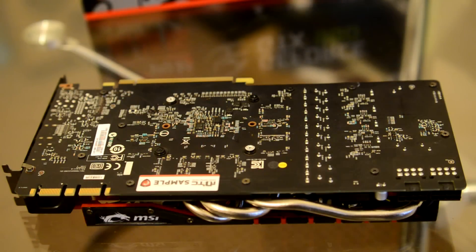The PCB of the graphics card itself is black, but you will notice there is no backplate. A lot of the GTX 980s released, such as from Asus, have included backplates which is a very nice thing — it looks better aesthetically inside the case, it neatens up and looks straighter overall. One can forgive MSI for this because MSI have used their own custom PCB. They've included more VRMs and more power phases, which obviously increases the overclocking capability and allows for much higher overclocks than you'd get with other models.